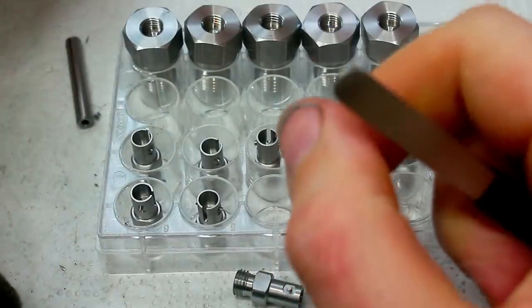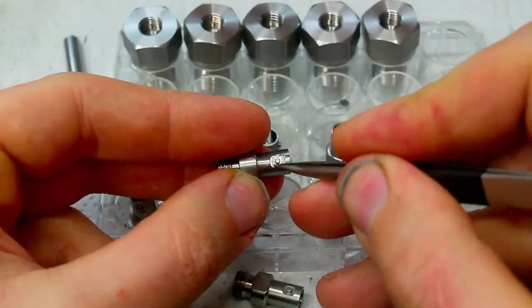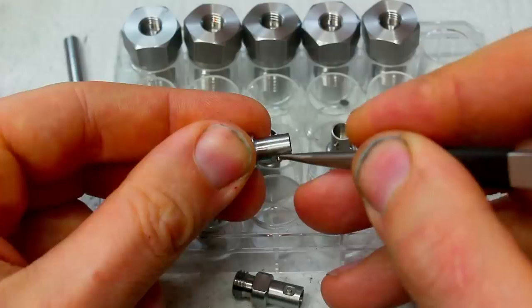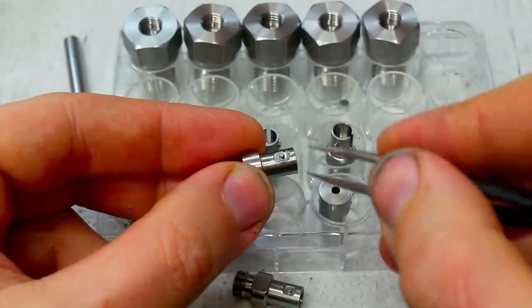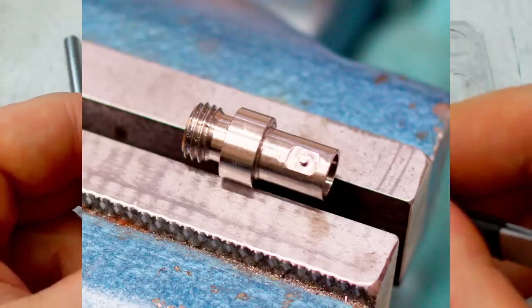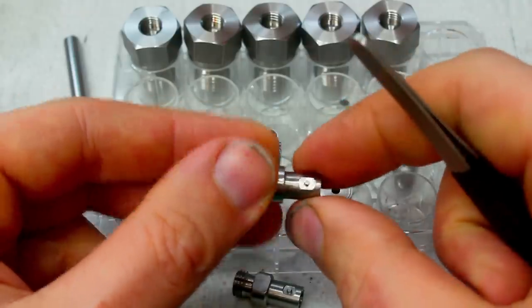I have the part, I think, it's this one. This one was done that way, rotary milling this feature and then whittling away all the material in between with the same 1 millimeter end mill. Then a little bit of hand blending. The pin feature looks terrible. This took relatively long. The 1 millimeter end mill is really not for hogging. It takes some sweet time to cut this feature on a manual machine.